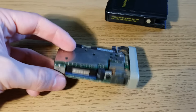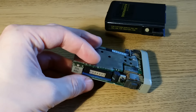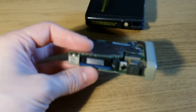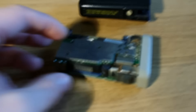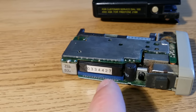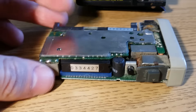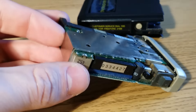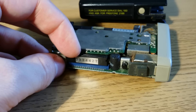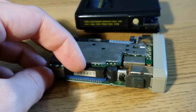Now that I've taken the casing off, as you can see we've got two separate boards connected together by a board interconnect system. The only removable component I can find is this small SIP package, which I assume works similar to a SIM card in a modern mobile phone. It's got a number on the back, so I assume this is some sort of identity or serial number. The fact that there's only one screw to remove the casing suggests this would be inserted by a retailer — they'd have these pre-programmed and when somebody signed up to a contract, they'd pop this in and give them their contact number.